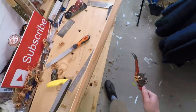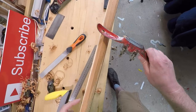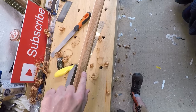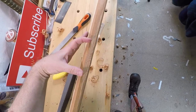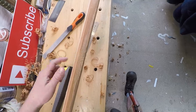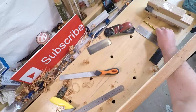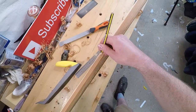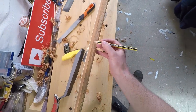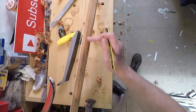Okay, again I'm going to be slow again because there may be other areas where I can't see, and then when we get to this danger area again with this swirl, you can already see where when we've cut it, it's slightly picked up. So that's the area where I'm going to stop. I can even mark that with pencil actually to help me to know to stop there, but then I'll be able to work this direction down the bow from here.